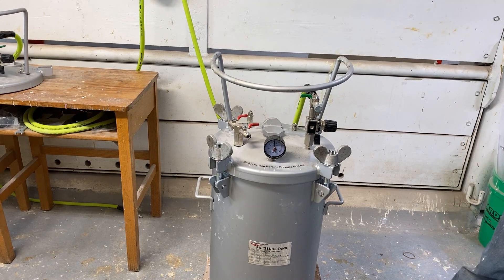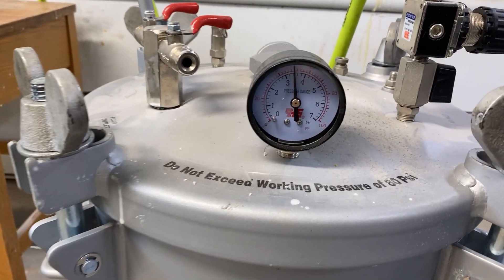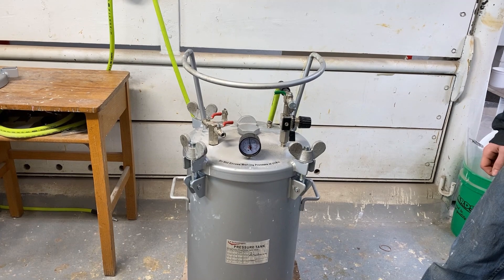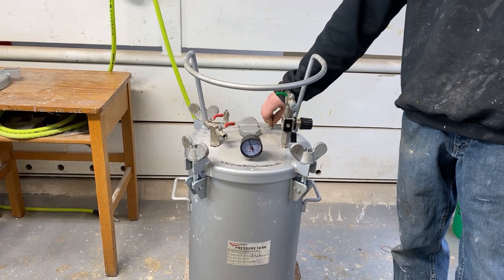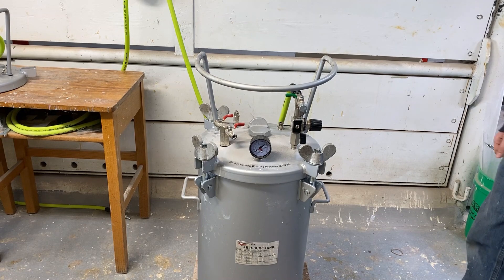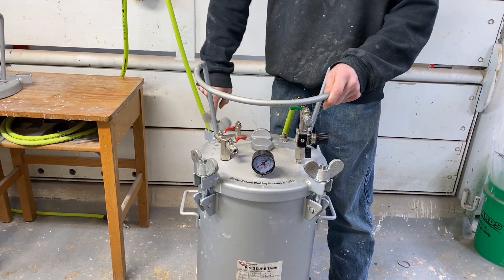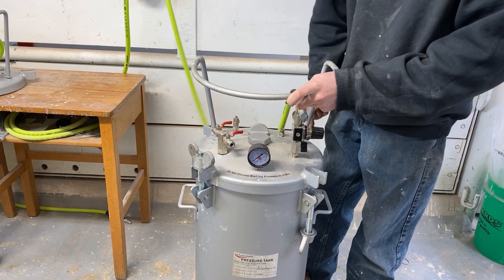Okay, we're back. What we're going to do now is release the pressure. If you looked at the pressure gauge, it did drop about two pounds through that ten minutes of sitting there, but that's fine. As long as it stays 50 PSI or over, that's really good. Now he's going to release the pressure — it's going to get loud. Now you want to make sure all the pressure is released before you unlatch the lid, because there have been accidents. People have released the lid with pressure still on it and it blows the lid off and can really hurt somebody. So just be careful and make sure all the pressure is released before opening.